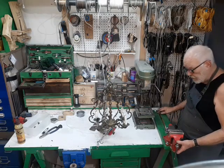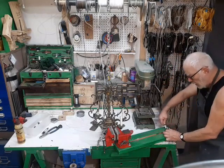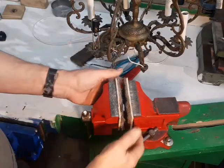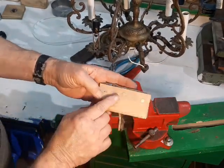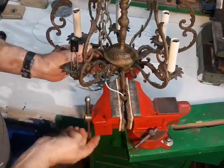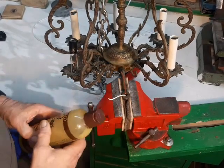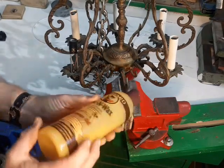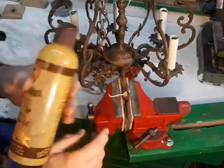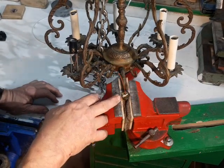I'm going to use the old wires to pull new wires through, and that requires holding this chandelier absolutely rigid — I just don't have enough hands to hold both ends of a wire and hold the chandelier still at the same time. I have thin pieces of plywood with rare-earth magnets on the back and carpet padding on the front, so I can clamp down a chandelier arm without worrying about it getting scratched or moving. Before pulling any wires, I like to use some beeswax furniture polish — give it a little squirt — which acts as lubricant because the insides of these arms can be kind of grainy and rough. I want the wire to slip through with as little effort as possible.